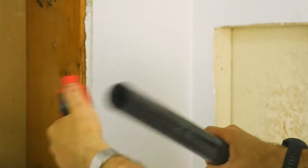Measure the drywall at 16 and a quarter — mark at the bottom, then take the straight edge. Do it gently first — don't want to cut yourself. Push down on your straight edge and re-score this a couple of times, maybe three or four times. You don't have to go all the way through because now we're going to break it — see it breaks like this. Then score the back, and there we go.